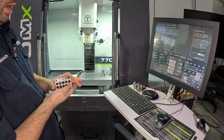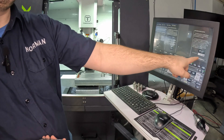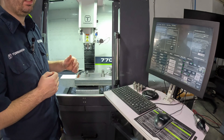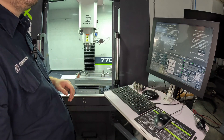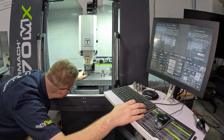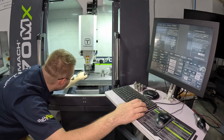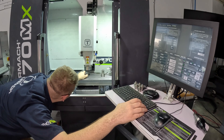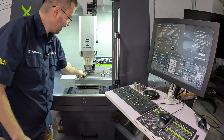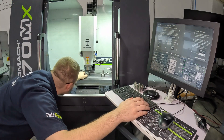If all you intend to use the ETS for is a tool touch-off, then that is the setup complete. But if you ever want to use the ETS to set the z-axis coordinate for your work coordinate, we have a couple more instructions to do. I'll remove the tool from my spindle. I have a 1-2-3 block here that we're going to use — we need some kind of reference surface in order to find the nose of the spindle and determine its actual height. We have a default value that's already populated but we do want to make sure we find the true value. I have tool zero set to make sure we don't have a tool offset applied. I'm going to jog my spindle down and touch my 1-2-3 block to the face of the spindle. On an MX machine we're going to make sure we touch on the face of the spindle, not on the bottom of the drive dogs — we're going to go between them. I always jog farther down than my reference surface and step up to make sure it can slide underneath, rather than stepping down on top of it and compressing the reference surface.